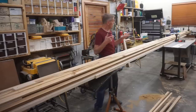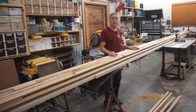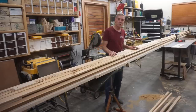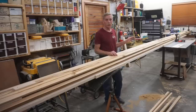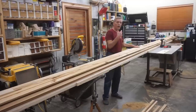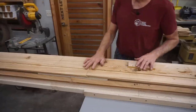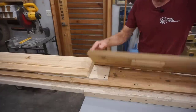And because there's a fair amount of stress on the face while I'm working with it until it's assembled into the beam, which is pretty structurally rigid, I want to make sure these joints are really strong. And so I've come up with something that I call a hybrid glue joint, and it involves using Titebond 3 glue and JB Weld on the same joint, and I'll bring the camera into the middle joint of the back face of the beam to show you what I'm talking about. And this is what the back of the joint looks like after I cut and fit the face pieces here.